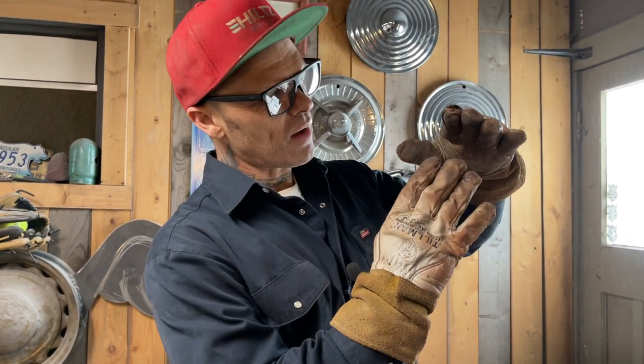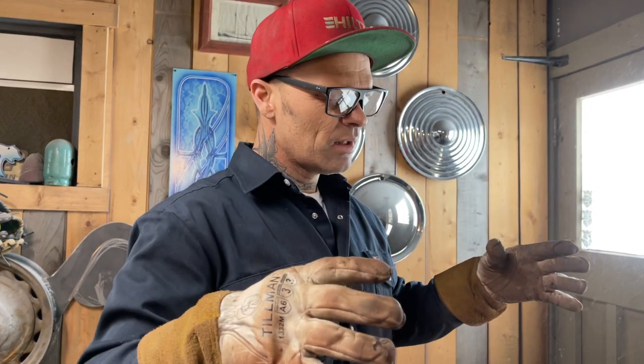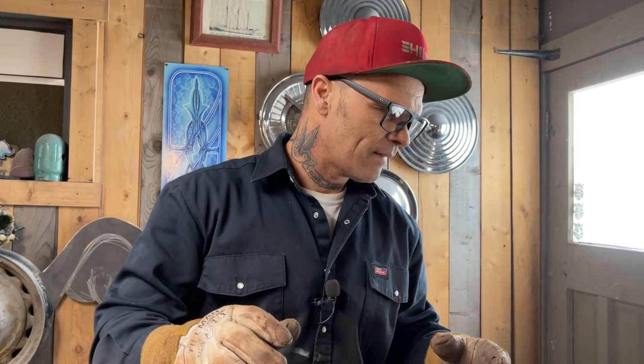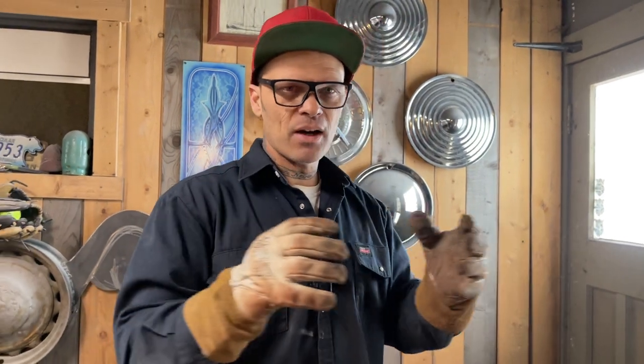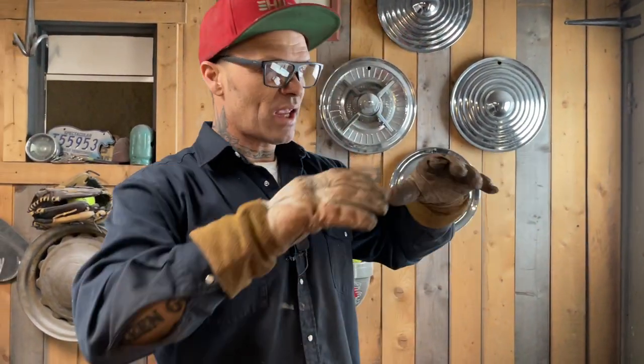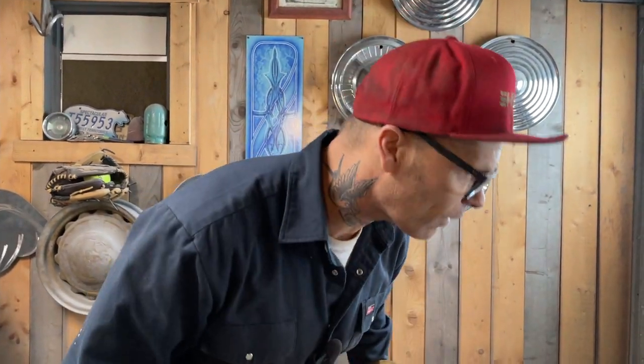I would say that the wheel is stretching. That's what the wheel does, stretch. Shrinking is another matter. When you're applying that wheel against another wheel and putting pressure on it, you are stretching it. I don't think that the English wheel shrinks. It's all stretch. To shrink something, you're more or less taking metal away or making it gather. That wheel is applying pressure and making it go out. So we've taken a flat piece of metal and stretched it so we've got shape.